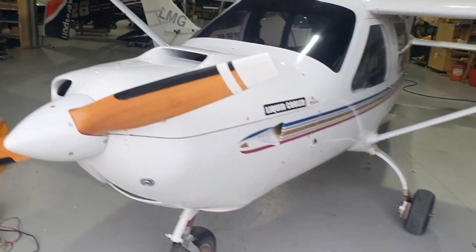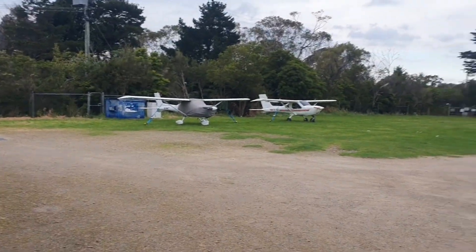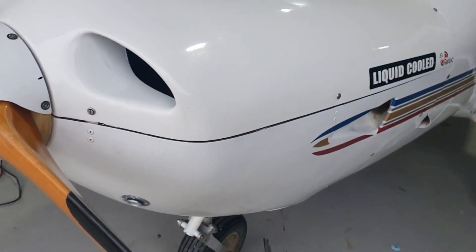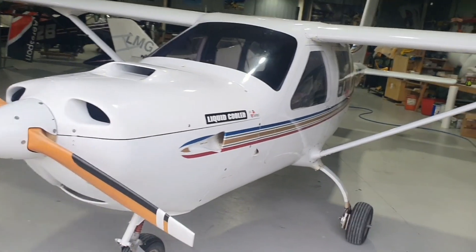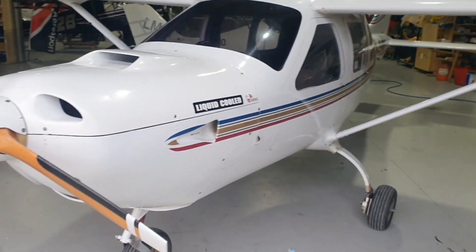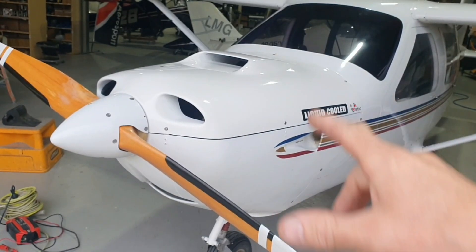A quick update — I decided the weather was pretty good here today, just at the end of the day. Wind calmed down to zero, no traffic in the area, and it's about 22 degrees. I decided to take the plane up for a quick spin — customer's aircraft after a significant LCH install. I'd been doing plenty of ground runs and taxi work. I really wanted to know how that scoop was going to pan out in the air. Sure enough, that gurney flap down the bottom with the slightly bigger opening, along with the converging duct in there — that's nailed it. Absolutely perfect.